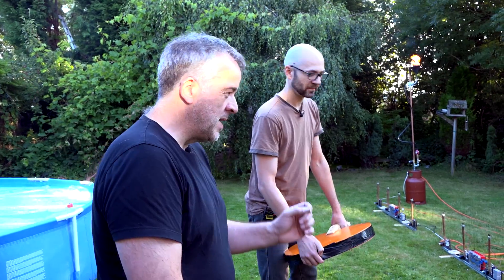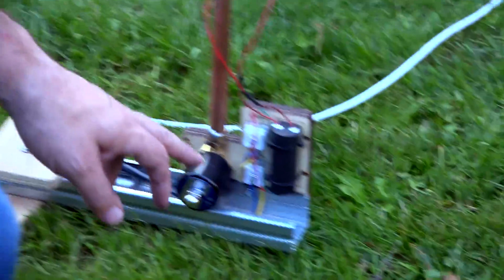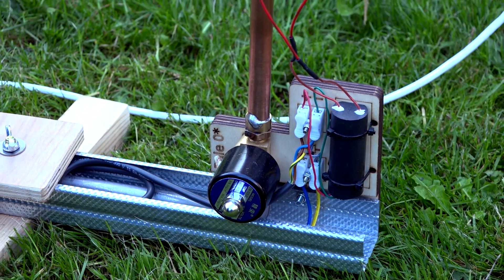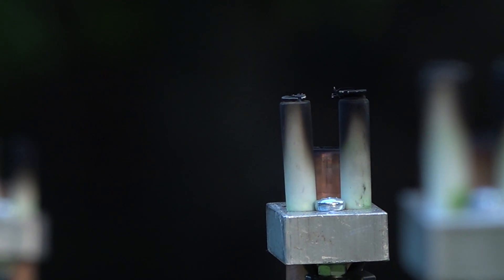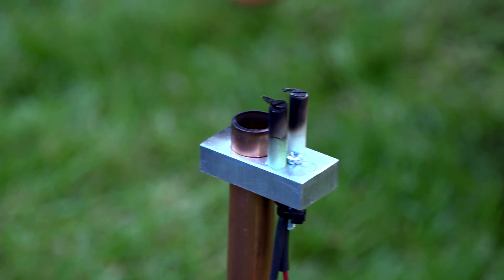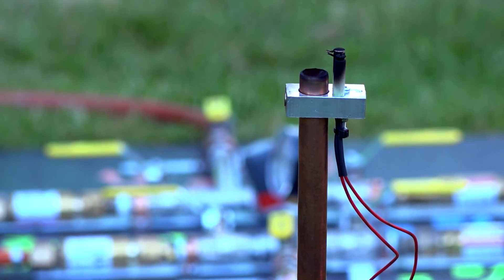One of the things we had to work out was how to light the gas. We experimented with things like barbecue lighters but they weren't really that effective. Then I came across these things — £1.64 from eBay. You put five volts in and you get a few thousand volts out. Another challenge was how to design a spark gap. We needed some insulators, so we've got a couple of ceramic tubes from fuses with screws in the ends and a machined aluminium block which just mounts to the right position.